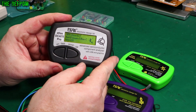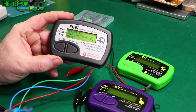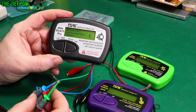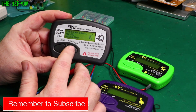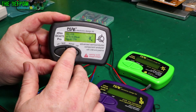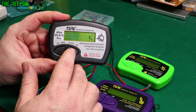The Peak tester says a beta of 220 — very close. Green is the left pin so that's the emitter, red in the middle, and blue on the right, so EBC — that matches as well. This one will also tell you a bit more information, like currents and voltage drops. So there's a bit more detail if you want to know more about what's going on.